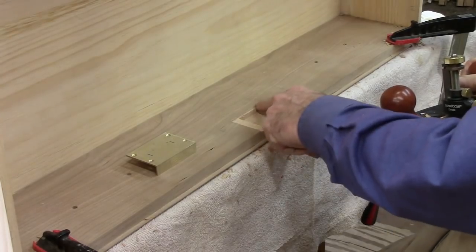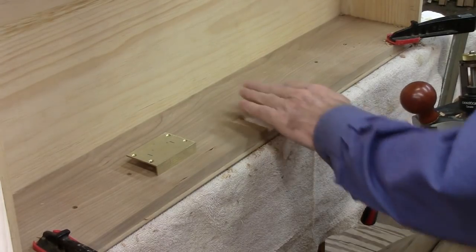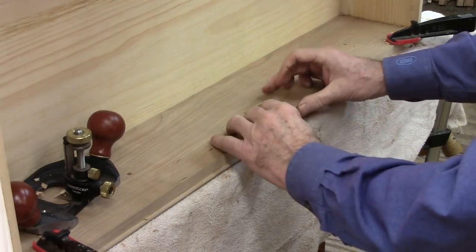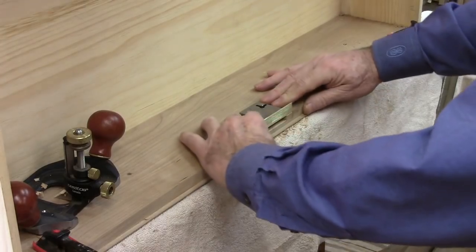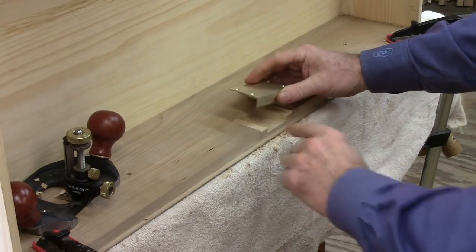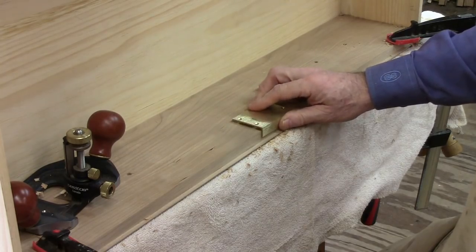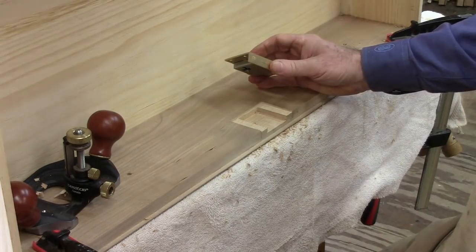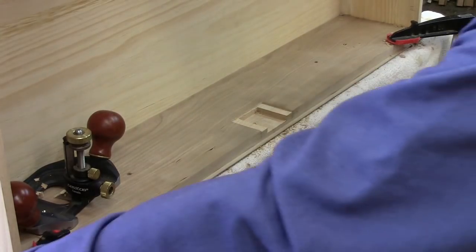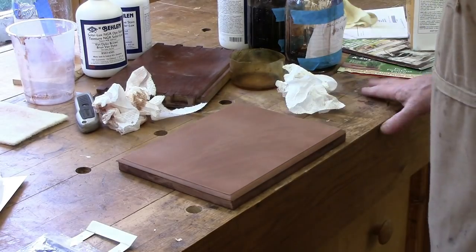I used the hand router plane to create the opening as well as the small recess around there. I've still got to take off the front to let it slide all the way back. As I used the router plane I was able to turn the lock over and feel for the depth, so we've got that set. Now I've got to take about a sixteenth of an inch off the top and then be able to press it to where the hole belongs, drill that, and then put the escutcheon and cut out the keyhole for the front.